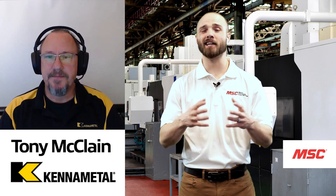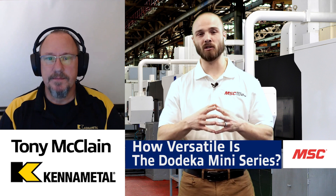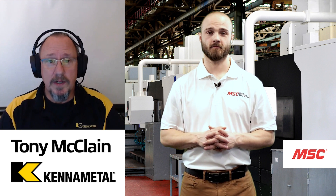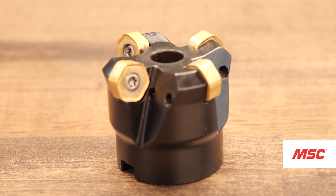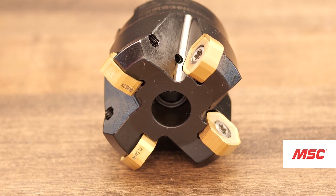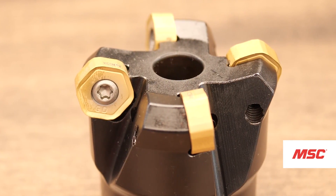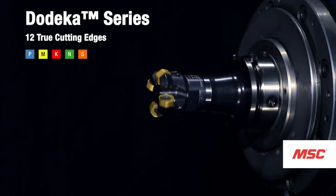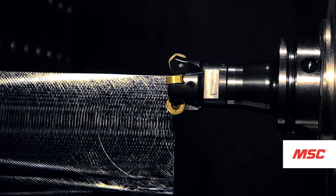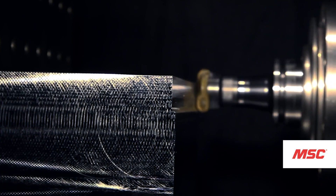This is a wonderful intro to a truly interesting tool. In your opinion, how truly versatile is the Dodeca Mini Series? When we speak about versatility, we have to look at indexable milling tools as a whole, whether it's a 90-degree shoulder mill or a round insert. The Dodeca Mini has a tremendous amount of flexibility. First off, it has 12 true cutting edges. It's capable of running in all major material groups, such as stainless steel, cast iron, non-ferrous, and high-temp alloys. It's very free cutting due to the different types of insert geometries, and it gives you the versatility to do a lot of different things versus just linear or planar face milling.